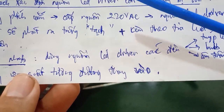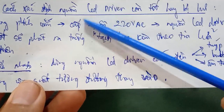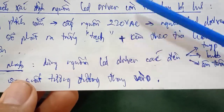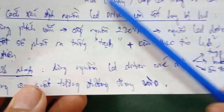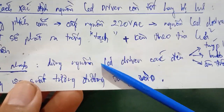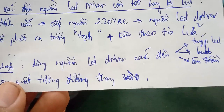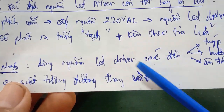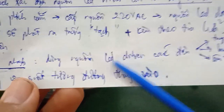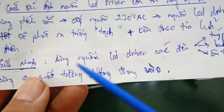This is the quick repair method. In previous videos I have guided you on how to repair the LED driver by checking and replacing ICs and measuring output voltage and no-load current. You can find those on my channel. Here I am talking about the quick fix: just replace the LED driver. Sometimes you can't find the IC or don't have time to repair it, so just buy a replacement LED driver. All T8, LED bulb, and recessed ceiling drivers of the same or equivalent wattage can be swapped — it works fine.